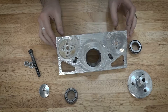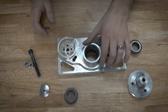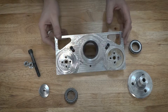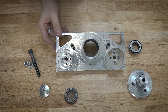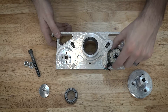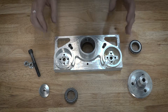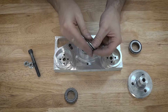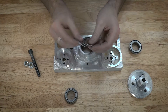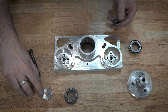I want to apologize for the shiny nature of this part — it makes it really difficult to film. Let's look at the weapon block. There was one little issue that actually caused a lot of problems. We have a motor here and a motor there, and if you look closely on one side, you can see a lot of gunk and discoloration. That's from the motor which ended up frying itself and turning into a fiery smoky mess. This motor basically exploded, and it stemmed from one major issue: the washers I use to hold everything in place. These washers are just severely cupped and deformed — they're supposed to be flat against one another and they very much are not.